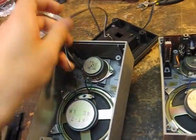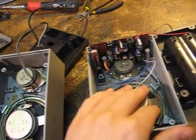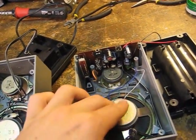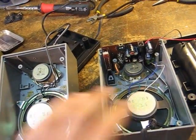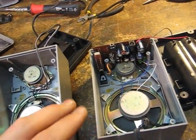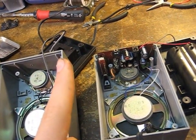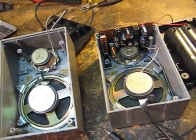There are two wires going to the speakers on one side — let's say this is your left side of the headphones — and here's the right side. There are two wires here and they're all going into the amplifier. So that's two wires, two wires, four wires total: plus, minus, plus, minus. You connect the two minuses — the two grounds — and that will basically be one wire. And then the two positives are going to be the other two wires, so that's three wires right there.